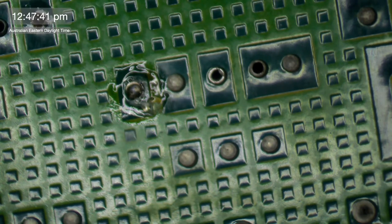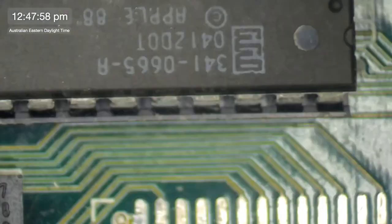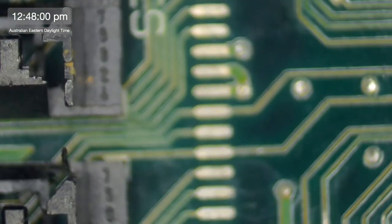Made some unpleasant noises last time I used it, so the analog board might need some attention first. Yeah, look, the Plus analog board, its main failing areas are typical. Look, every time these get a year older, there are always new problems that they can potentially develop. But with most of the Pluses I've found, usually the problems are related to either resistors or diodes. Not so much capacitors, but, you know, sorry, gonna wobble again. There we go.